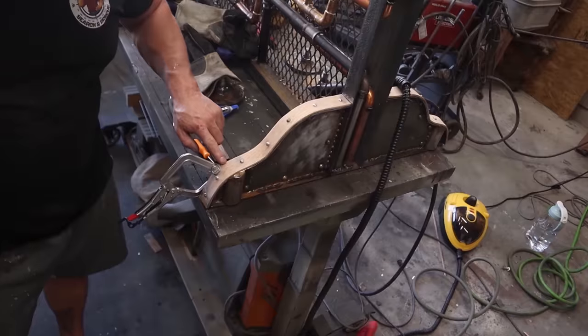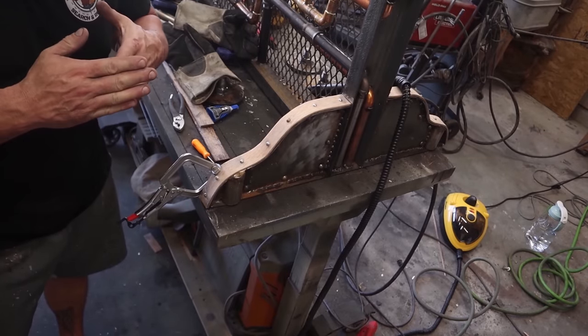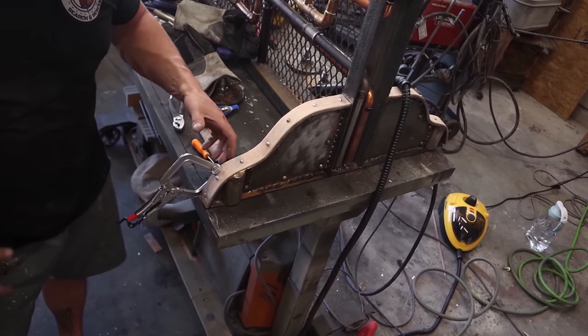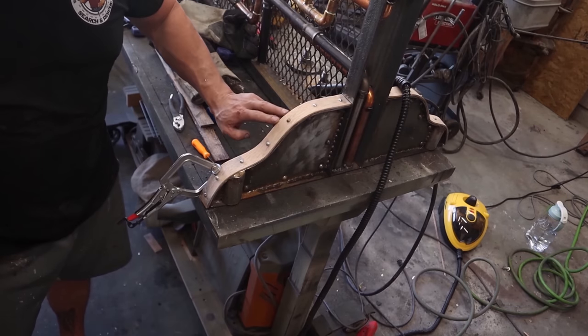Got a little bit of a split right here on the corner. I think it was just coincidence the way the wood grain went through there. It just gave it a spot to pop up. I tried to put some wood glue on it, put it down. That wasn't holding it. So I went ahead and put some gel super glue on there, crimped it down, and then I'll sand it down smooth. But I think it'll be all right. All the rest of it's coming out pretty good.